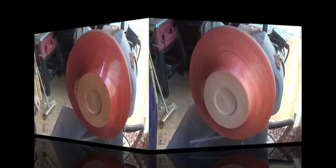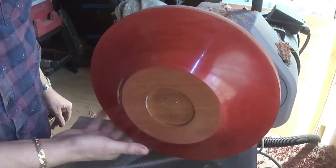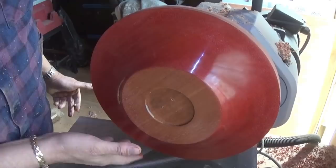I'll just give that a coat of Woodwax 22, the Chestnut Woodwax 22. That's just had one coat and it's like a mirror. It's beautiful. It's all down to the sanding. So I'm very pleased with that. I shall give it a coat of microcrystalline to protect it against nasty fingerprints. And then I'll turn it round.